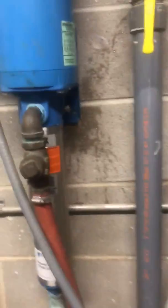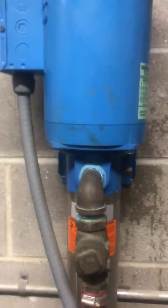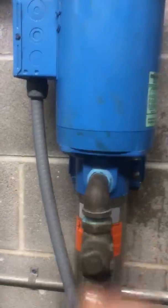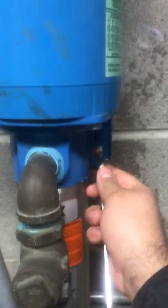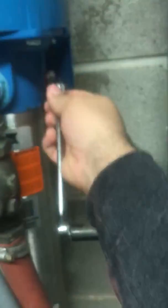When I say to prime the pump, I mean just making sure all your water is on and your tank is full — as you can see, this tank is full to the top, so we know it's good. Make sure your water supply is open, and then make sure the pump is off. That's a really important part — make sure everything is off so the pump won't turn on while you're doing it.